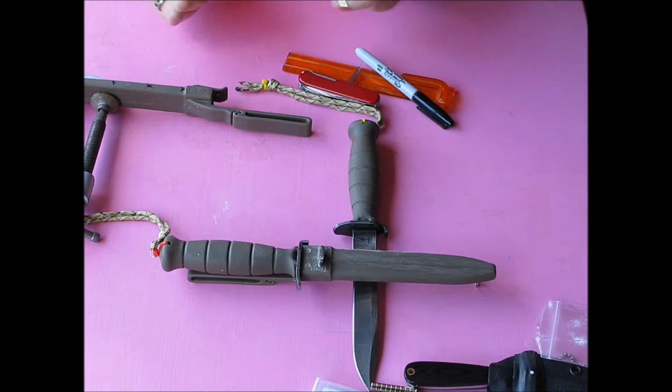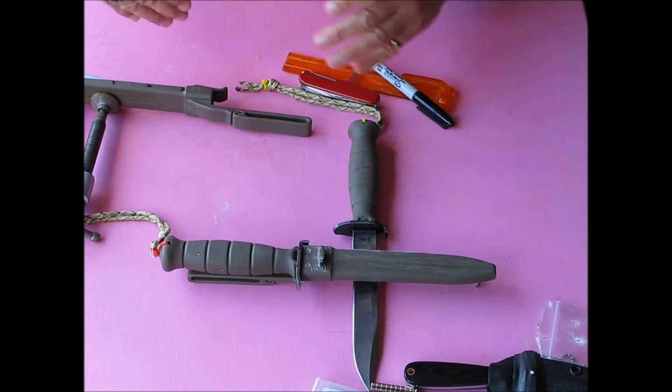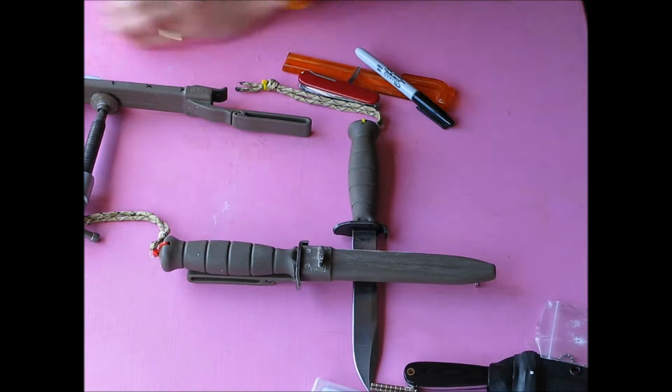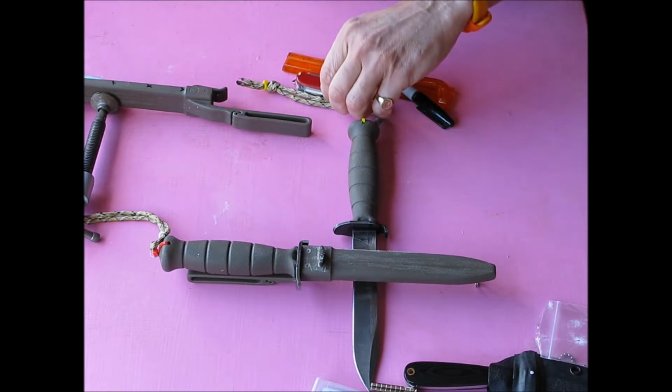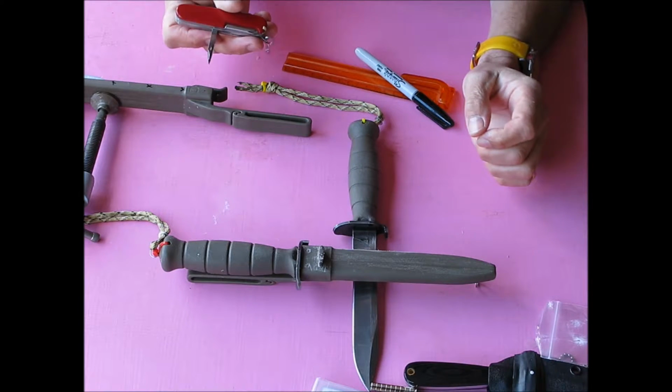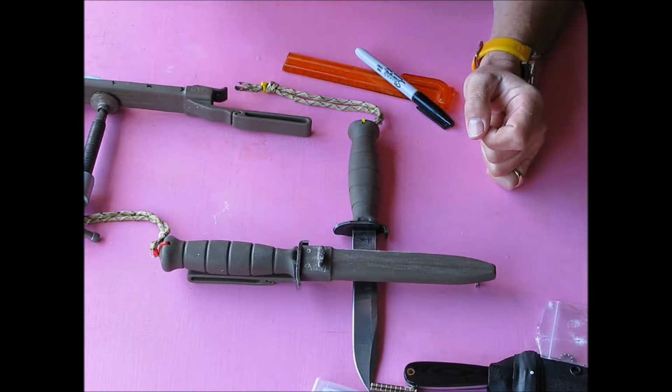Just be very careful when you are holding the drill that you don't go too far down and that you keep the drill vertical. So just make sure you get a good position. Maybe standing up's better, and just make sure that when you start drilling, you don't go too far down and that you don't wiggle it around. It's easy if you're standing above, and if you've already made a start hole with the awl, then there's much reduced chance of the drill point slipping on this material. It will actually tend to go straight in.